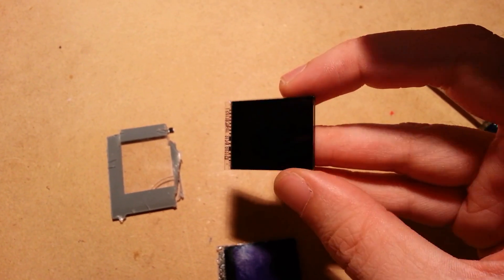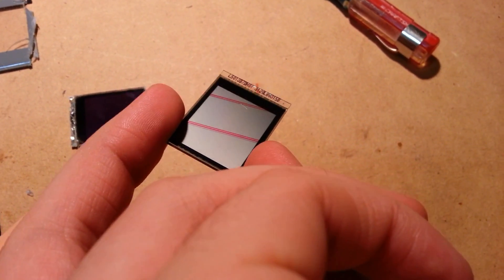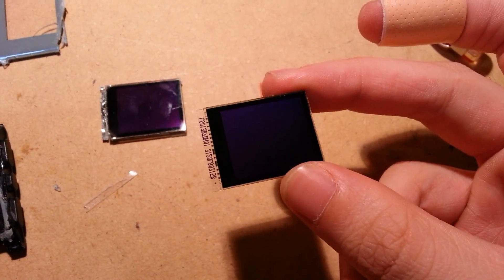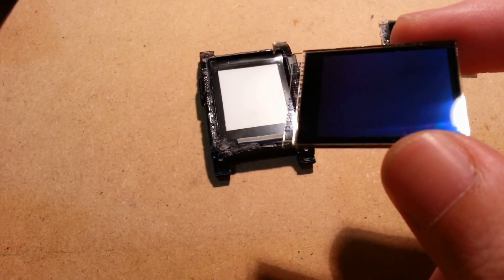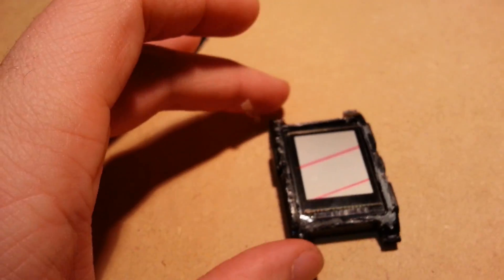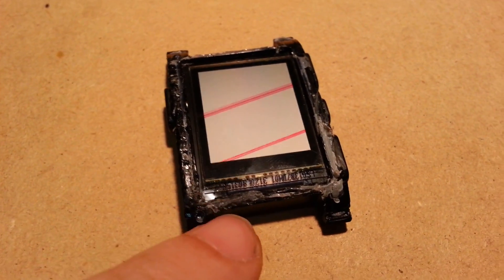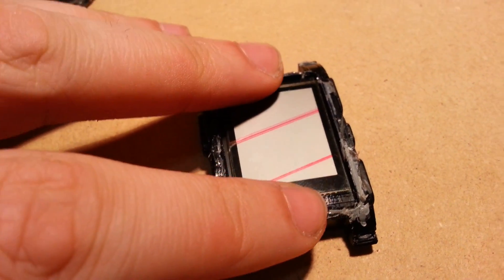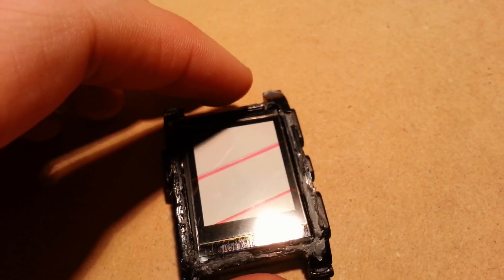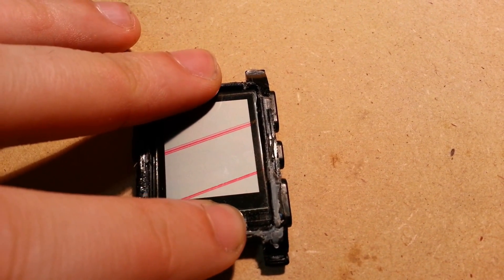I very carefully peeled the film off the back of the new screen — the film on the front side is still there. As you can see, there are little edges along there which are the equivalent contacts. The datasheet explains that it's just pressure contact with the bottom little piece of glass. As you can see, the bottom little piece of glass is right above that thin film contact, and once I get the pressure on it — there's the screen — it comes on.